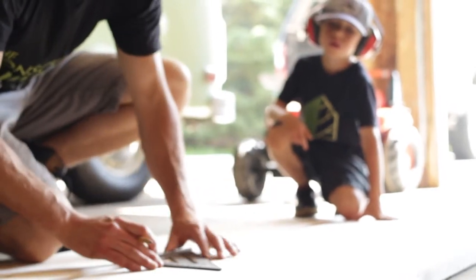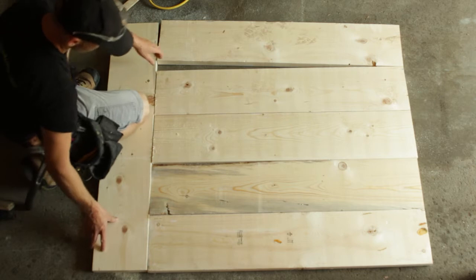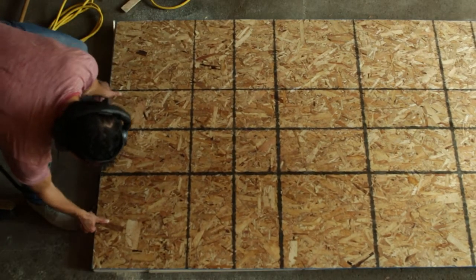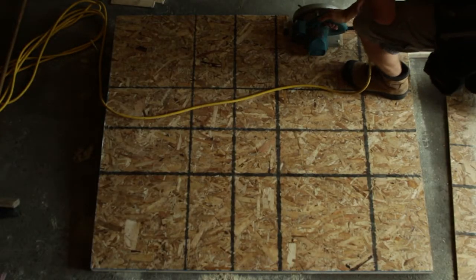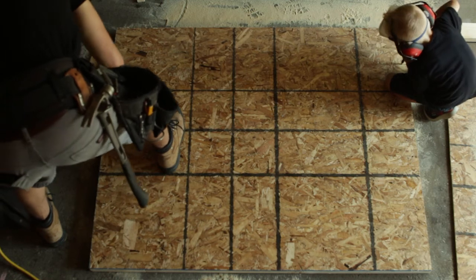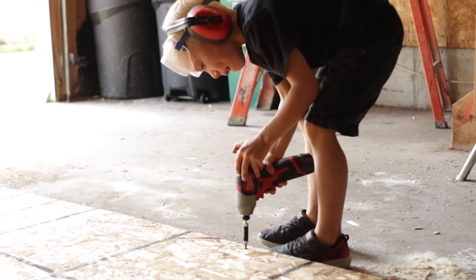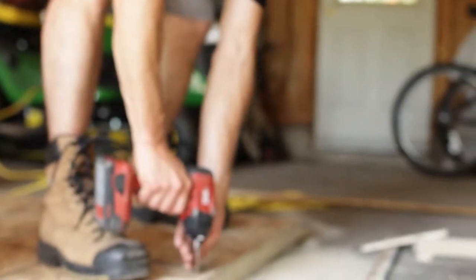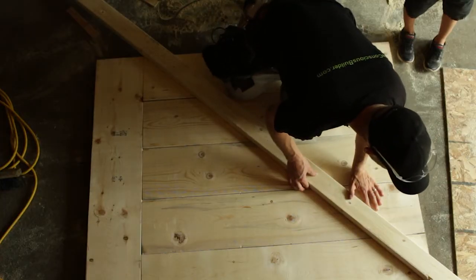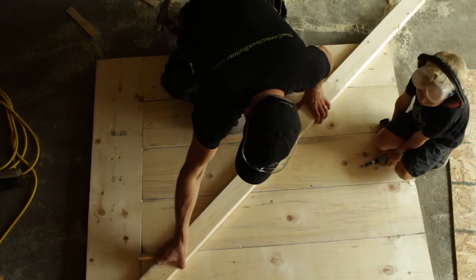First, take your three 8-foot 2x10s and cut them in half. You will lay out five boards side by side, and one across the top of those five. Then lay out the OSB or plywood on top, square everything off, and cut that OSB or plywood to the same size as your 2x10s put together. Attach the OSB to the 2x10s by screwing around the perimeter to avoid putting screws where the axe might hit, since hitting a screw could gouge or dull the axe.